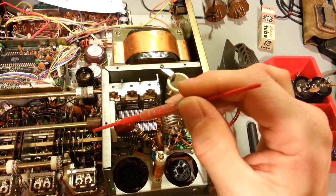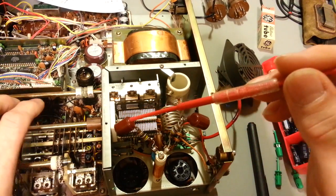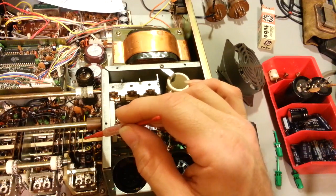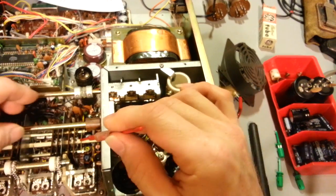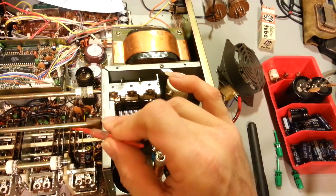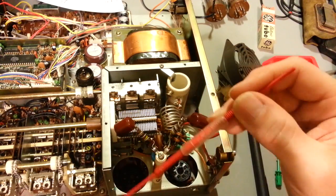It's not the easiest thing in the world to fix, because you have to pull the board out, then you have to dismantle it, take the shaft out, take everything out, and dismantle it progressively, depending how far back in you need to get. Desolder the circuit board, take it out.